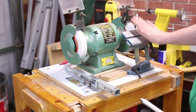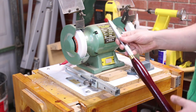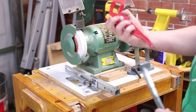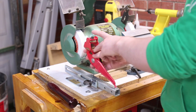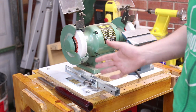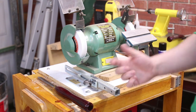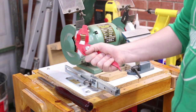For straight edge tools, having a tool rest makes it very easy to put an edge on. But for curved tools like this spindle gouge, it is a lot more difficult — it's not a straight curve, you actually have to rock back and forth to get the compound curve into it. So what is typical for turners is to have something that will hold the tool in a position and let you rotate it. In this case I've got the Woodcut True Grind jig. You put your tool in this part and rotate it back and forth, which gives you the proper arc needed to make the cut. There are many different sharpening jigs that all do roughly the same job, and you can make your own. The most popular is probably the One-Way Wolverine jig, mostly available in North America. Vicmark also have their own, and there are plenty of tutorials online for building your own system.